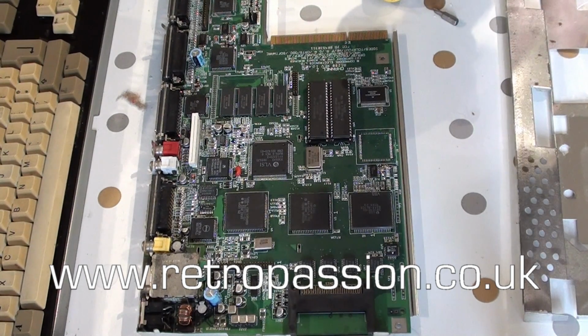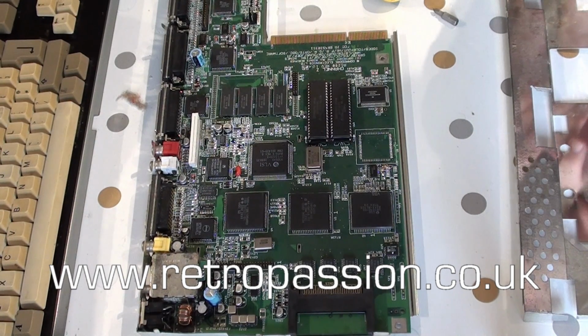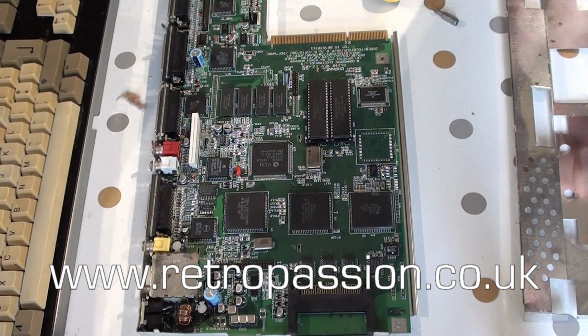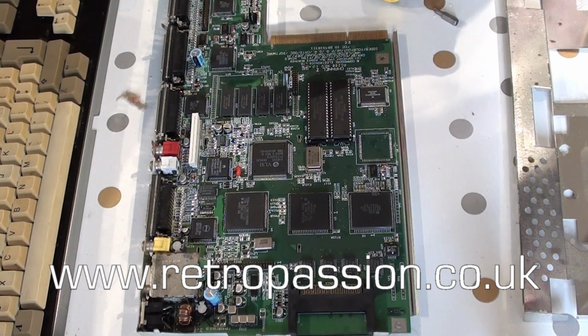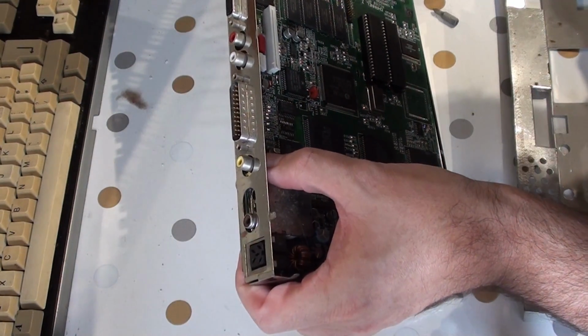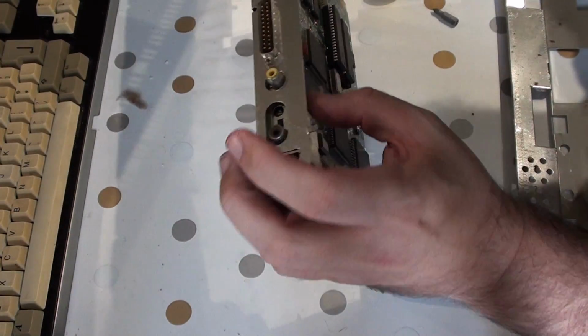It's going to get sent off, basically, to the guys I spoke to, who were very helpful in helping me understand the difference between a polymer and electrolytic. I'm going to go for the polymer ones, because effectively it's a hard substance, so they're not going to end up having the same problem. Now the other thing is, I just want to quickly check this bad boy, because, no, it seems okay, but it does seem a little bit off.